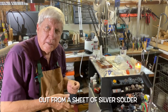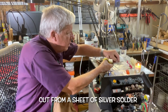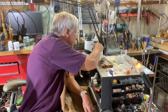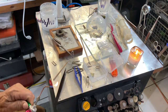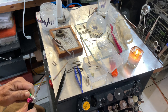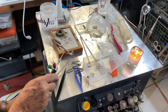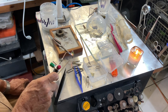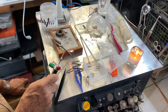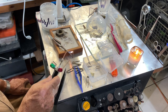We're using the EZ solder. So we've cut a few little strips and we're going to put them inside this little bin here. Now the piece of solder is on. So we'll just get the torch going with a little oxygen. They're suggesting I need a little yellow flame and let's heat up the bottom of the unit first, and slowly bring the heat up until we see that piece of solder cover the entire piece.